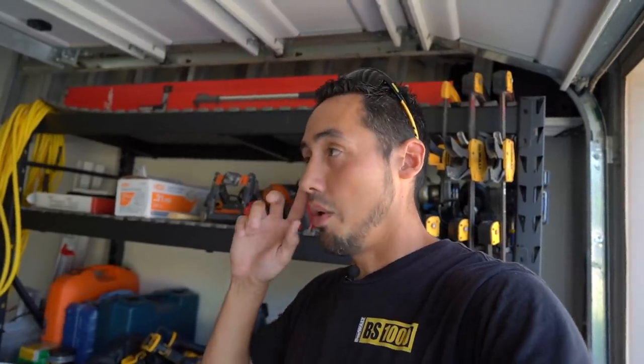Welcome back to the channel. Welcome back to my house. I'm making some progress here and I'm going to be installing some more crown molding. If you've been following the last few videos, you know I've been doing that here, and I actually have another room that has two 45-degree angles, so the cuts would be somewhere around 22.5 degrees, and I thought this is a perfect time to test out a new tool.